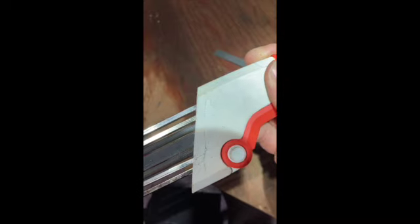Next we're going to sharpen this chain. Here are the tools you're going to need. You can use just a regular old round file if you want, but this one's pretty easy — it's got a guide on there and even a pictogram that shows you which direction to go. Pretty sweet.